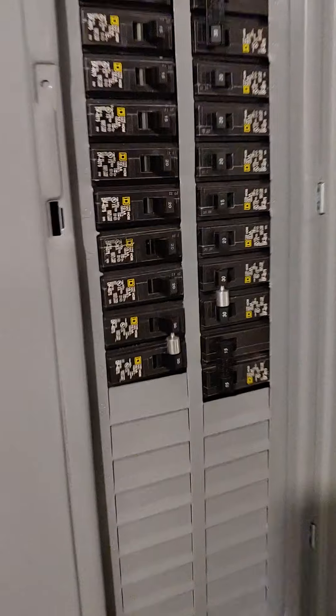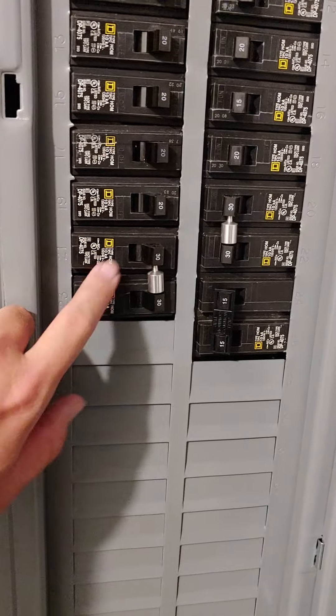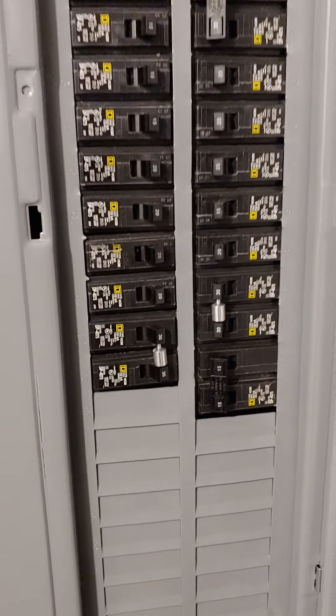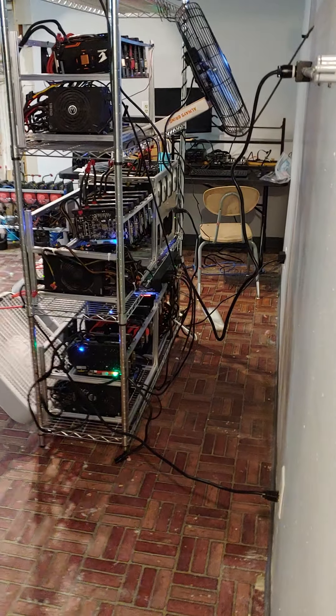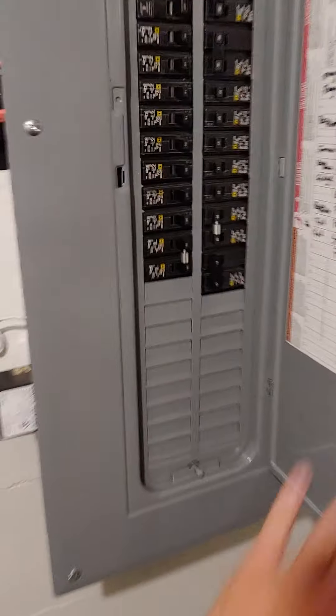He went kind of beefy — I don't know if I really needed to do that. Each plug is on a dual 30 amp pole, which is probably more than I need. I also sprung for the surge protector, so I've got a 15 amp surge protector on there for added security. The nice thing about the NerdGear power splice is it has its own breaker, so it's like an on/off switch for the PDU — I can just do it right out here.